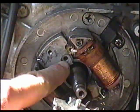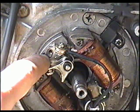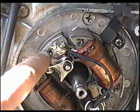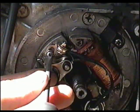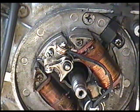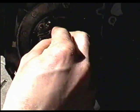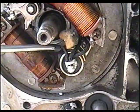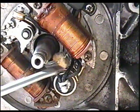Insert the points into the proper holes, then install the little screw but don't tighten it all the way — leave it loose for now because you'll need to adjust the points later once the flywheel is back on. Make sure the wire is tucked down out of the way of the flywheel. I've tucked the points wire in behind the felt.